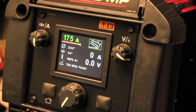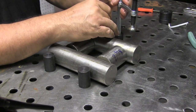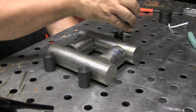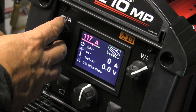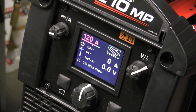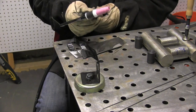I'm up pretty high amperage here. I'm going to be welding some pretty thick stuff — inch and three quarter thick, round stainless bar — and that's the base of a bend fixture. Before I fire up on this, since I haven't even lit up on this machine yet, let's run a lap joint, 11 gauge, about an eighth inch thick. I'll set it at 120 amps and we'll just make sure everything is going to come out okay.